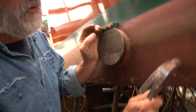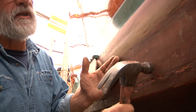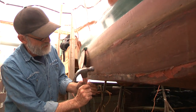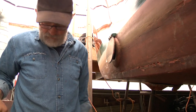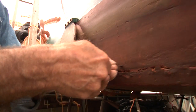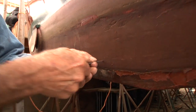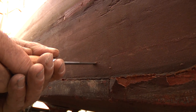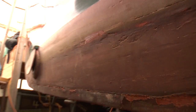I don't think the issue was holding power in the transom framework. Taking one more look at the bottom plank of the transom — I'm really displeased with this. It sounds so hollow here; it's either checking so badly in a vertical sense that it makes it sound hollow, or there's some softness on the other side. I'm going to probe it with a knife to check the condition of the wood. Oddly enough it feels pretty solid, but I can see the plank pulling in and out just with my knife tip — I can pull that knife back and forth and actually move the plank. So it's not fastened up very tightly.